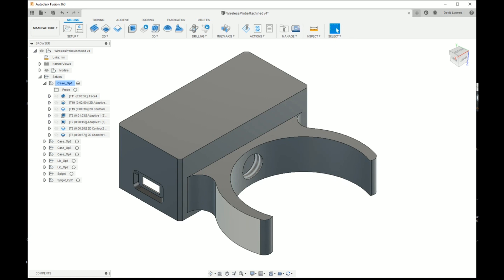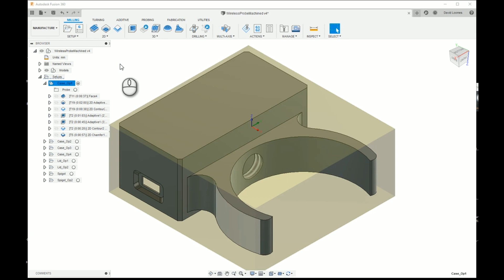Without further ado, what we have on the screen at the moment is the probe mounted enclosure for my wireless probing conversion. It's a nice example because it's simple enough to show here and complex enough to bring out a couple of the useful things you can do with probing. This is the first op - you can see the outline of the stock and the WCS origin in the middle of the top surface. The position of the WCS origin is much less critical with this probing than it is normally. You don't have to be able to probe that X, Y or Z directly. It's generally enough that you can, before you start, take whatever tool happens to be in the spindle, jog it down to within a few millimetres, and zero the DROs, then let the probe do the rest. Top centre of the stock is a pretty good place to do it - just eyeball it and off we go.